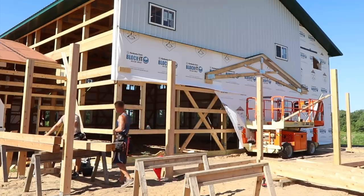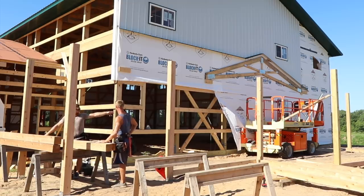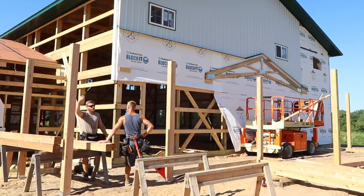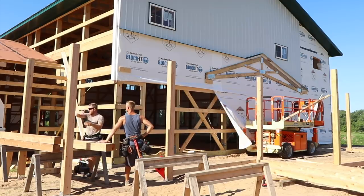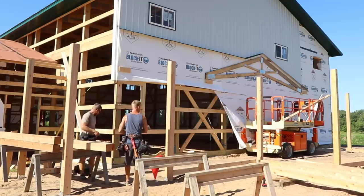I'm gonna cut a miter on this. Let's get clean cuts coming this way and we'll plumb it up. So we'll basically build around and then we'll plumb that corner up. We'll put this guy on. We'll set these up, we'll plumb that corner, and we'll mark it right where I wanna cut it, and then I'll cut it. Then I'll put this miter on, plumb it up, mark it, cut it, then we'll fit. Okay? So, good. Go ahead, get these guys stood up.